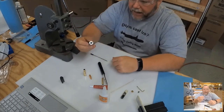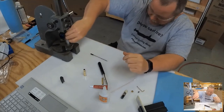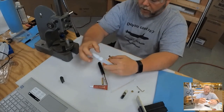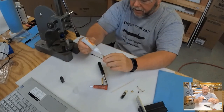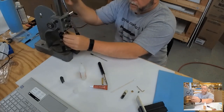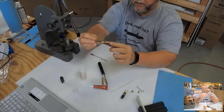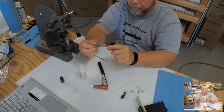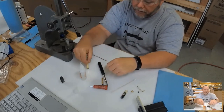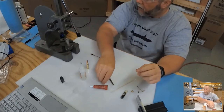I have a template jig on my arbor press. I put my bullet in it, then take my casing and put a little dab of medium CA in the neck — just enough that when you press it in it'll hold. I press down until I hit the aluminum, and there is my press depth. I always turn them upside down afterward so any excess CA runs away from the neck on the bullet.